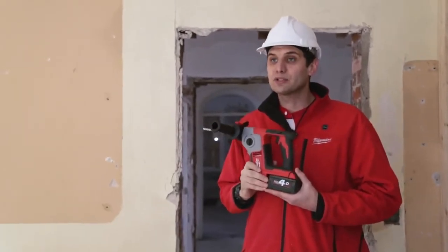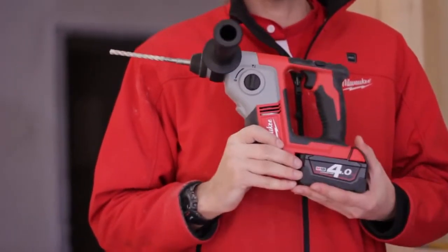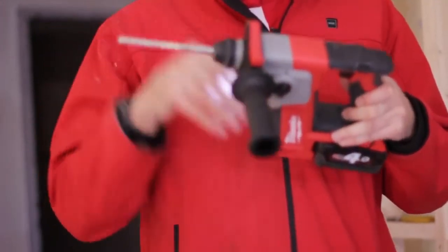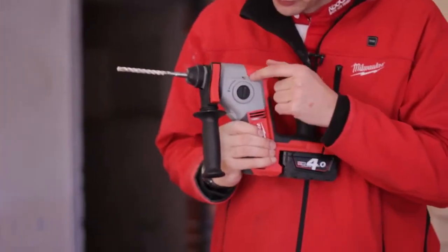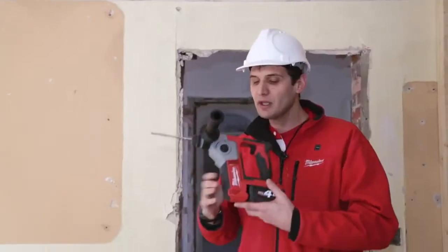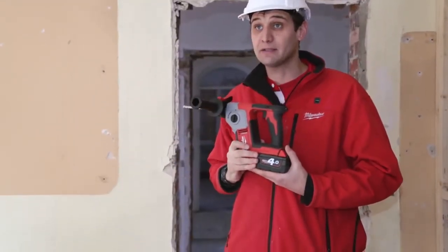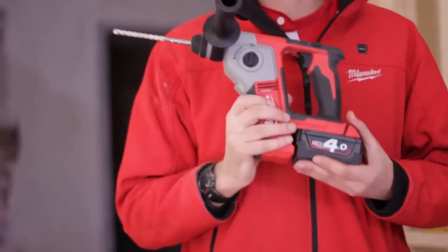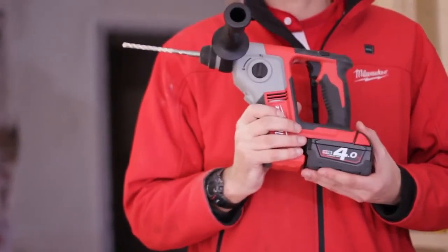Optimum drilling diameters 4 to 12 millimetres with a maximum of 16. As with all the hammers, they come as standard with a 43mm neck size that fits our M12 HammerVac dust extractor on. It's a two mode hammer, as you can see from here. Has 1.2 joules of rated blow energy, which is 20% higher than the competition in class. Produces 7000 BPM and 1300 RPM.